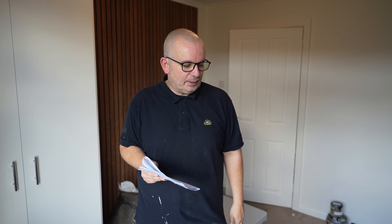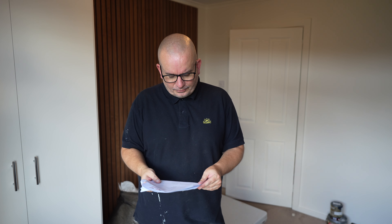The caulking gun was £9 from them as well — some of you will already have one of those. You could also screw these to the wall if you've got plasterboard walls — black plasterboard screws straight into the felt, which would be easy. But I found the adhesive a piece of cake. It grips within the first press — I held the first panel for a long time but the last one I just patted down for about 30 seconds. It literally grips as you put it to the wall; you can still wiggle it slightly for a few seconds to get it perfectly in position.